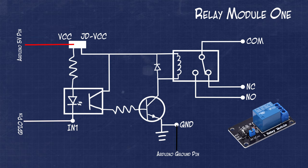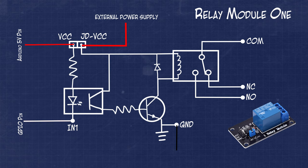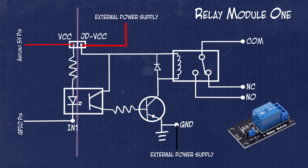To protect our micro and completely opto-isolate it from the relay, we need to remove the jumper between VCC and JDVCC. We also need to disconnect the ground pins between the two boards. To provide the required power to operate the relay, an external power supply can be used. Here we'll connect the positive wire of the external power supply to JDVCC and the negative wire to the ground pin on the relay module. In this configuration, our microcontroller will still sink current between the VCC pin and IN1 when IN1 is low, activating the optocoupler. Now when the main transistor is activated, instead of pulling power from the microcontroller's 5V rail, it will come from the external power supply. This will of course activate the relay. Now if something were to go wrong with the relay, there's no direct path back to our microcontroller.